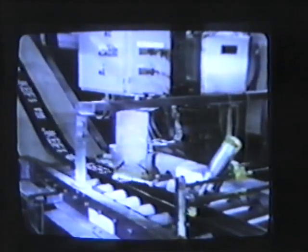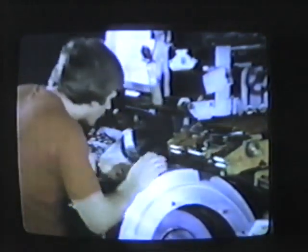Meanwhile, the tire tread has been manufactured on a multi-story automated extrusion line, longer than a football field. Extruded from its steel die, the tread is permanently identified by a kind of king-size dot printer before moving on to second stage tire building. Here, the tire builder begins by wrapping the first of 2 steel stabilizer plies on his band building chuck. The steel cords run at a precisely controlled angle. These belt plies will be right under the tread in the finished tire.